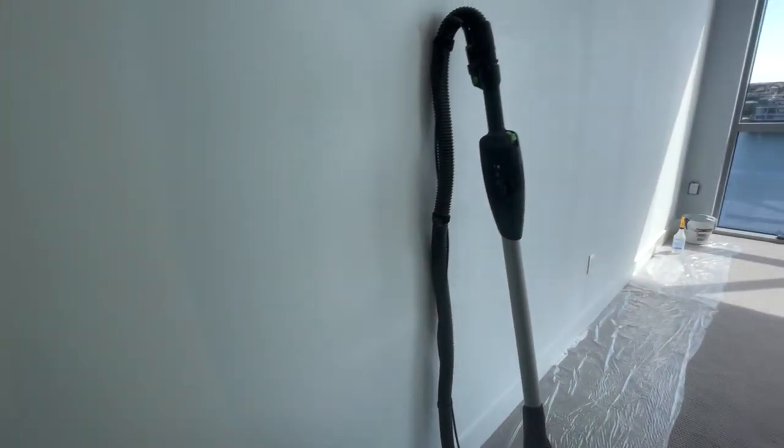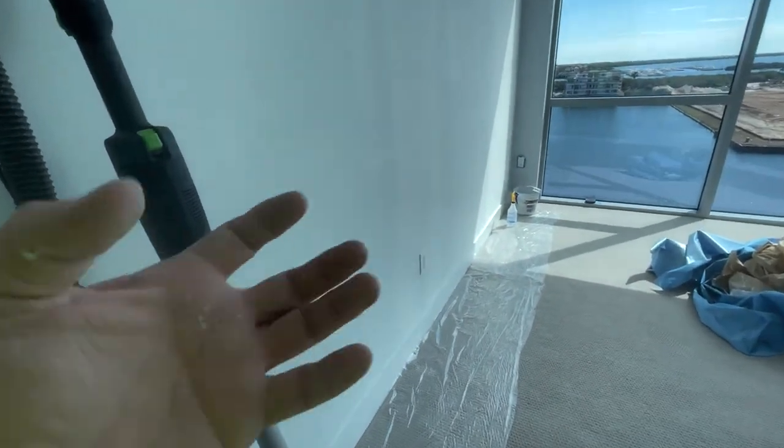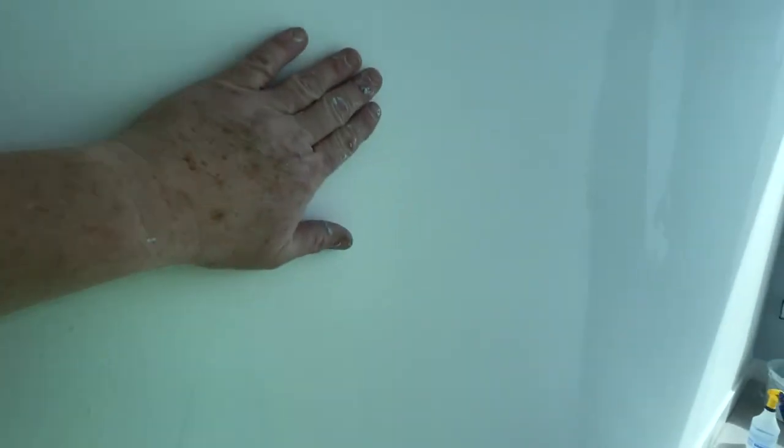Prime it right now. Prime it. Get the paint on it. Create the shell that's going to prevent this. See that? When you prime it, you're going to put a shell on it. It's going to protect it. On top of your primer coat, after letting it dry for 6 hours, you'll have a hard shell. I suggest you do acrylic. Then skim these edges and then skim out any imperfections like this.